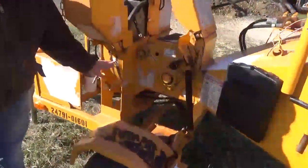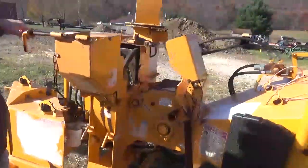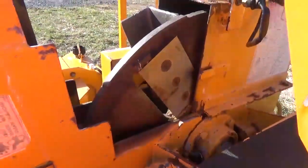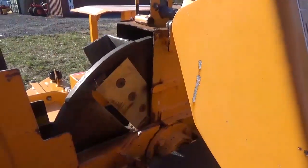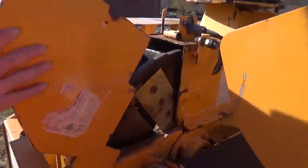There were a couple little scars here on the side where a piece of material went through. In here, your chipper disc — the disc is in nice shape, the edges are still nice and squared, not all rounded over. It has brand new knives in it; they've never been turned because we just put them in. There are brand new knives in this chipper. The chipper main bearings and stuff are good.